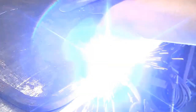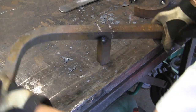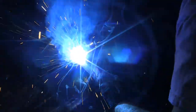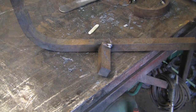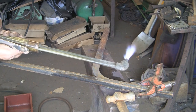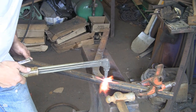I'm going to use a little bit of that inch and a quarter — it's just about right to fit in my anvil's hardy hole. I'm just going to flash this on there, and you'll see why it's at an angle in a minute — it just makes life easier. Actually, now I've done it, I've thought about it and I've done it wrong. I should have put it on the side and stuck it up both ways so it's sticking out top and bottom — then I could just turn the jig over, which would make life even easier. So if I use it again that's probably what I'll do; I'll knock that bit of bar off and put it on the side. Now you can see why it's at an angle — so I can get to it. I've clamped the angle iron onto the short end, and it just makes life easier with it being at a slight angle. You have to sometimes think about these things a little bit ahead of time.